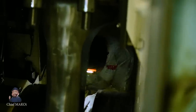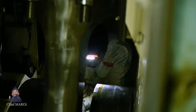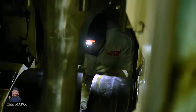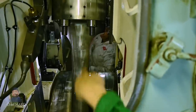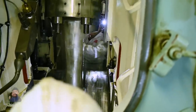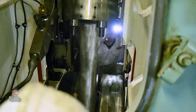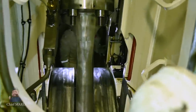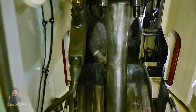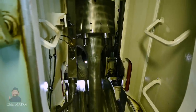This job is usually carried out by the second engineer. It is done by using a dial gauge placed in between the crank webs, and then repositioning the crank pin to be as close to bottom dead center as possible without dislodging the dial gauge, after which the gauge is then set to zero.